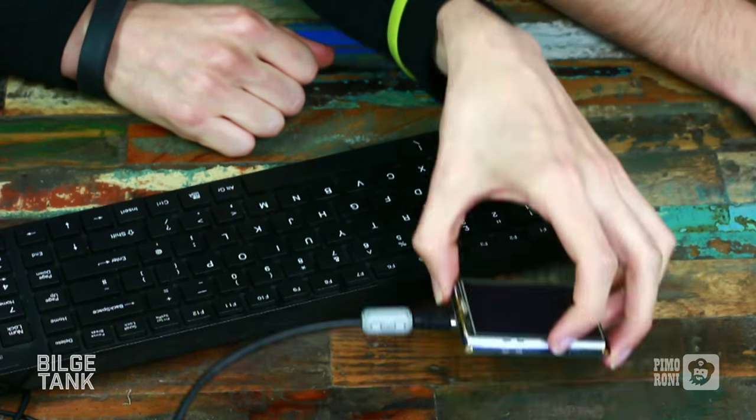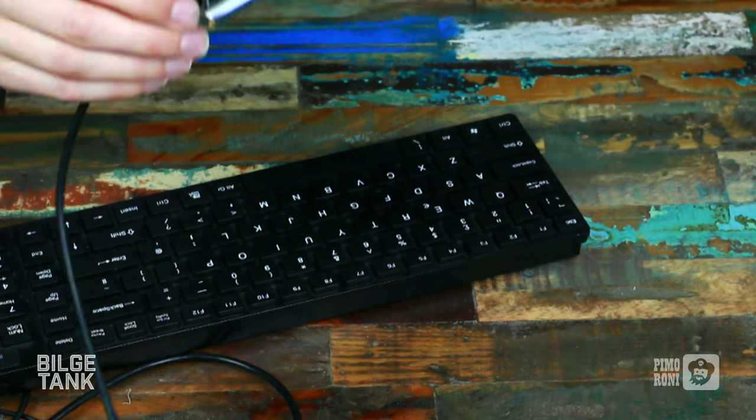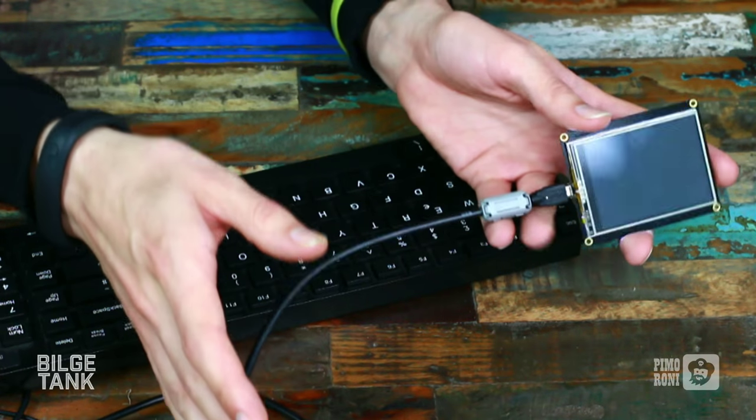Can you make it display something? The extras folder isn't quite finished yet — I've had the 7-inch display on my desk with this connected and have calibrated the offsets and settings so you can run the RoboPeak and the 7-inch touchscreen at the same time. You can use this touchscreen and it only affects what's on here, and the main touchscreen only affects the main screen. The next step is getting something like Pygame running full screen on this display, so you can have your main display for developing code and an auxiliary display with an interface or game using the touchscreen.